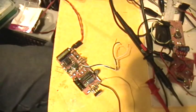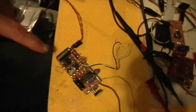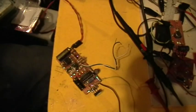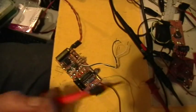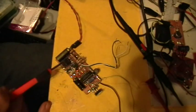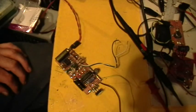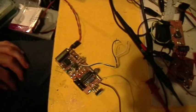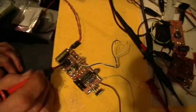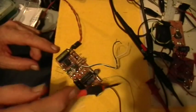Welcome to my laboratory again. This is continuing testing stage by stage of this Aquila 3 volt perpetual flashlight. I still don't have any inductor, but I did get a DC-DC converter chip, the MC34063A, out of a USB adapter. There's the chip there. So now the circuit is complete except for the inductor.